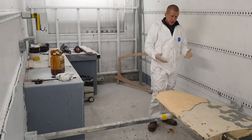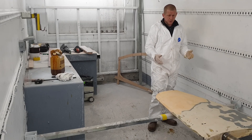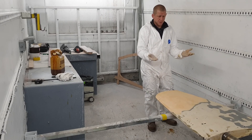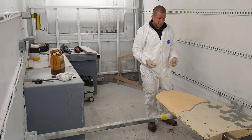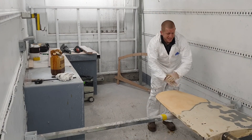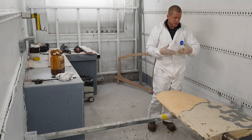So this is the plug stage of the thing done. Hopefully you got something out of what you've seen - hit subscribe and like the video so you get notifications of everything else we do. The next video will be making the mould - we're going to make a part mould around this, a split mould, so it'll be a two-part mould. The third part of the video series will be making the two skins, gluing them together, and making it complete. Hopefully this was useful - this is making a plug for a rudder, but the same process applies to anything, whether you're making a plug for another part of the boat. If you follow these basic steps, the shapes obviously change but the processes are exactly the same.